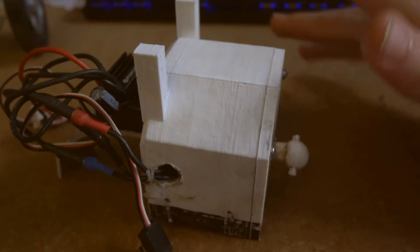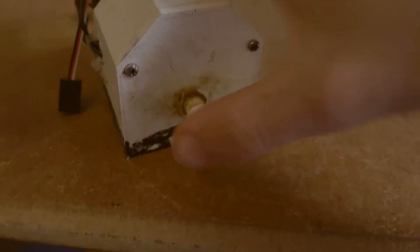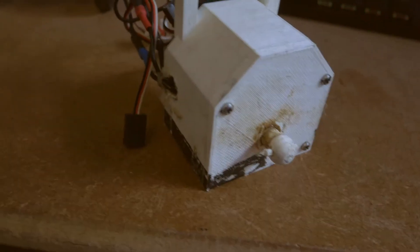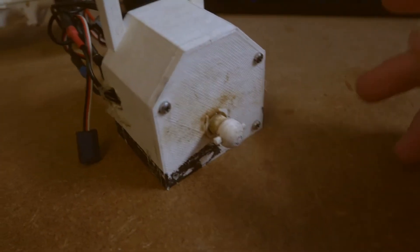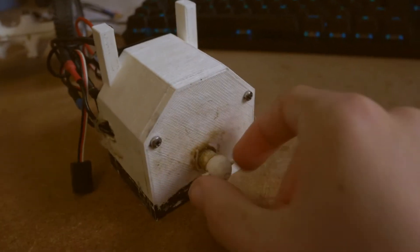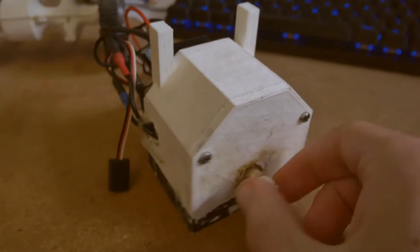So it does suffer from going around circles quite a lot. This is just a CV joint, the exact same one as I've used in my truck — 14mm diameter with two pins. These prove to be really reliable in their new form. They rarely ever come out so they're actually quite hard to get off, but they run really smoothly, and this one has got some grease in it. Everything has been greased — the motor and this hole here as well.